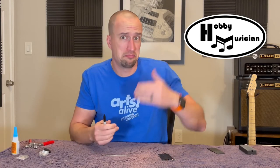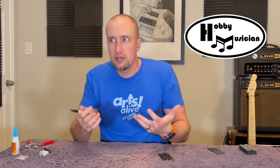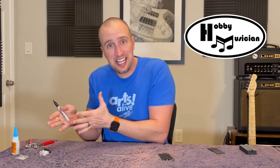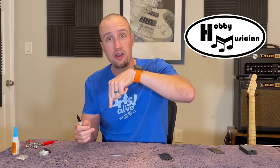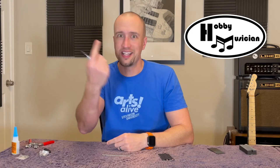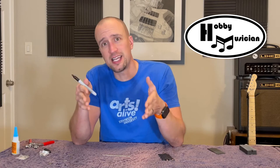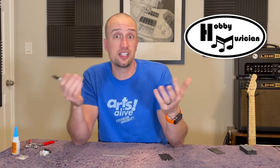When you're dealing with a guitar that has more than one pickup — neck pickup, bridge pickup — it's pretty important to control which polarity end is pointing up. On one pickup we're going to have all the black dots pointing up and wind the copper wire in one direction. On the second pickup we'll put all the black dots pointing down and wind the wire in the opposite direction. That way, when both pickups are in the same circuit, we don't get interference — we actually get some hum canceling.